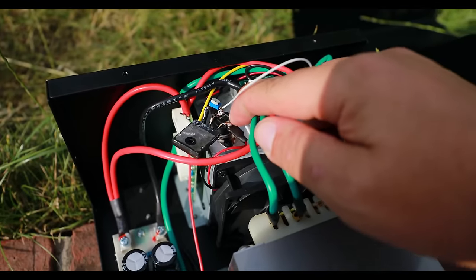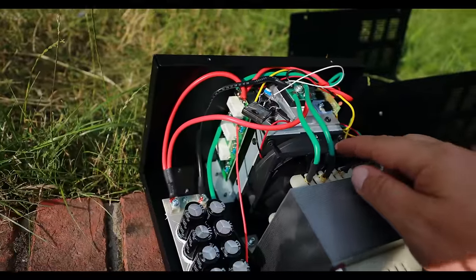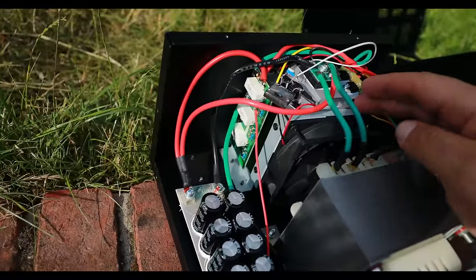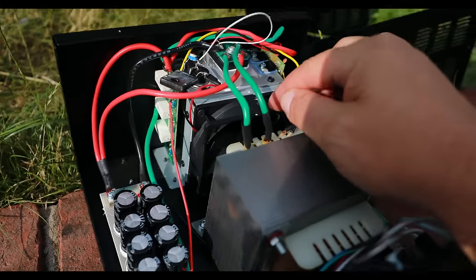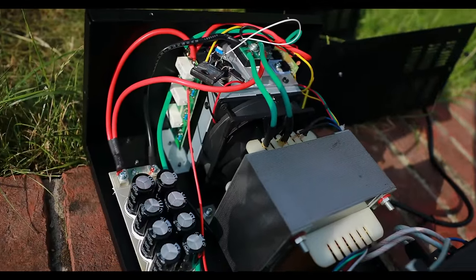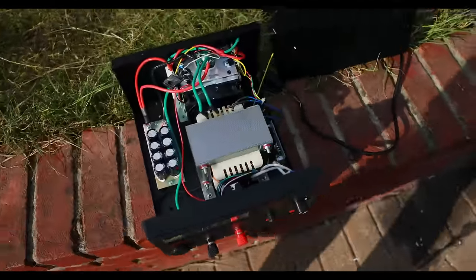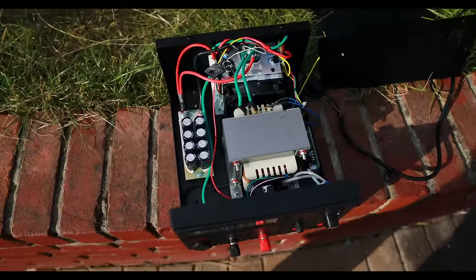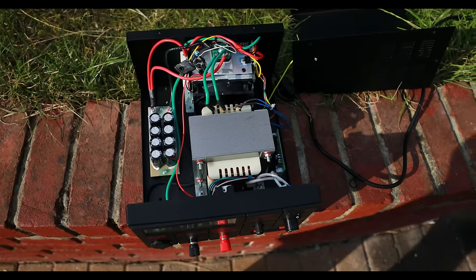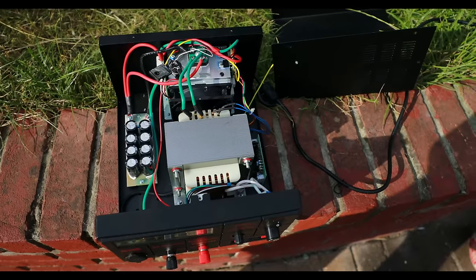It's a mechanical switch that's switching the fan on and off. This is a 12V fan, and when the heat sink reaches around 60 or 70 degrees, the fan spins at full speed. I mean, I'm in my room and when the fan starts I get scared — it's insane. So the only downside of this cheap power supply is the noise. Even if you replace the fan with a silent one, it will be the same problem.